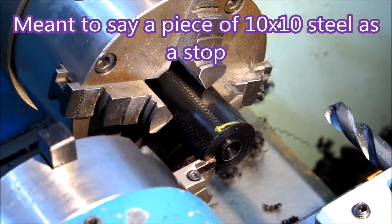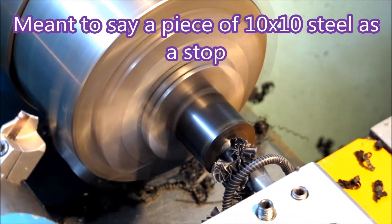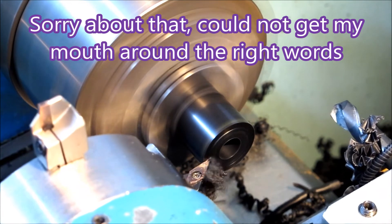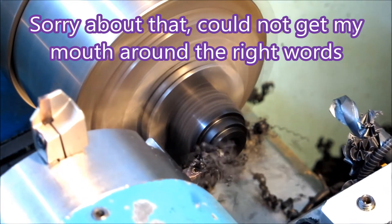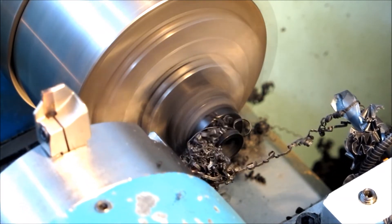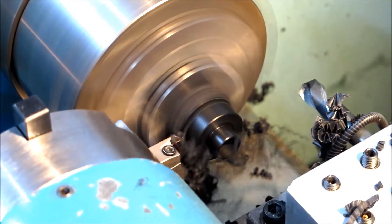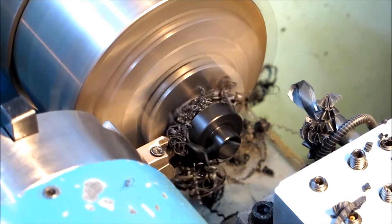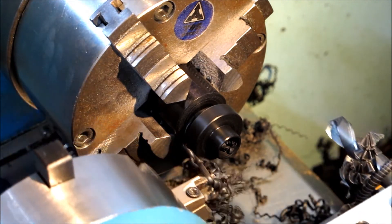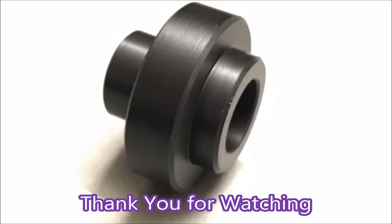Using the boring bar as the stop for parting. I didn't think that would be knocking the tool around too much, so I didn't worry about using a proper parting piece of stock. And that's generally how they work — they work quite well. Not too much drama with the swarf wrapping around the part. But generally that's how they finished up — not too bad for the balance of the 30 odd parts I had to make. That's the finished part, and thank you for watching.